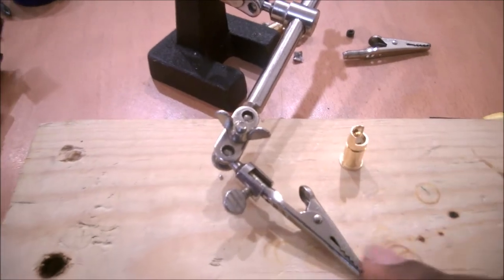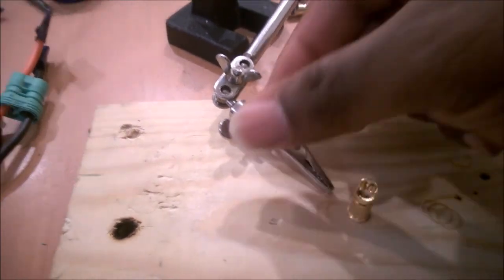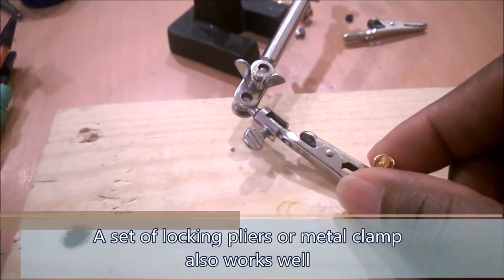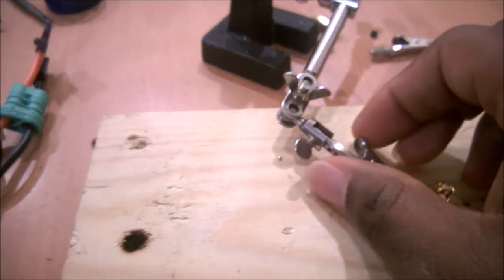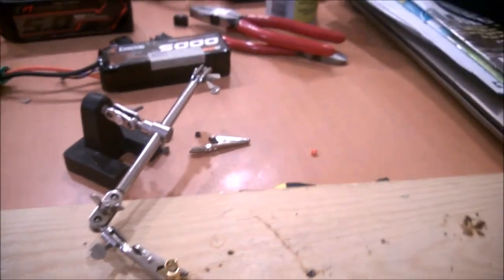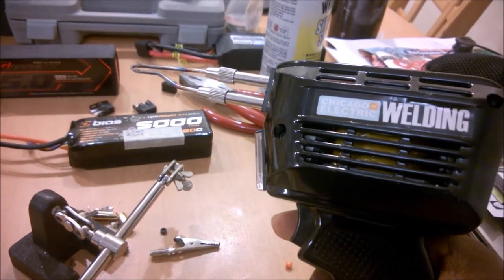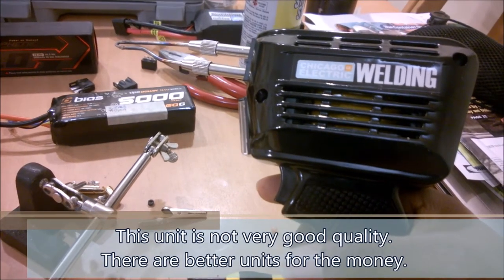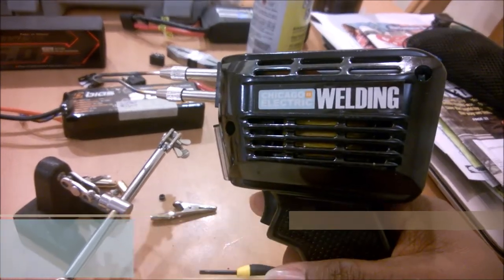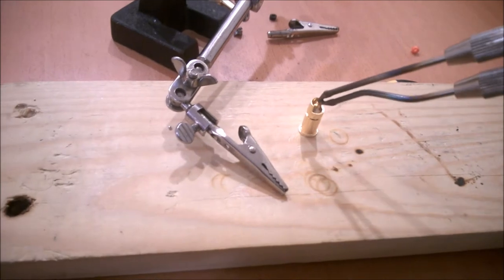After that, I like to have a little piece of scrap wood to work with. You take the bullet side and you can do it just sitting on its own — I have my little helping hands here to hold things in place. Get this guy nice and secure, point it in the right direction, and then use the soldering iron. For my large-scale big battery connectors I use this monstrosity — a 180 watt soldering gun from Harbor Freight. But a 60-plus watt corded soldering iron will also work really well. This is overkill but it was on sale for like 20 or 30 bucks.